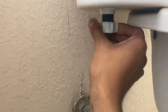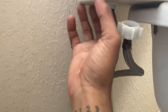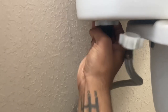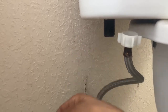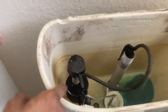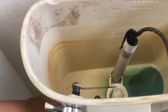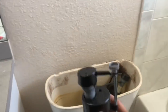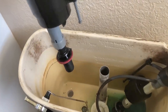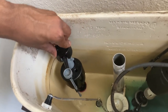This one's gonna be the water line right here. I'm gonna get a little wet but we'll clean this up afterwards — we won't leave it for the tenant like that. This is the washer that comes with our kit. We just loosen this plastic nut and push up, or we can come up from the top and just lift up. There's gonna be water spilled everywhere. I didn't think it was gonna be this much water, so let me have the tenant bring me a bucket or a rag. Just take this, drop it in — the gasket has to be on the top, inside the tank itself, so that the water doesn't flow through.